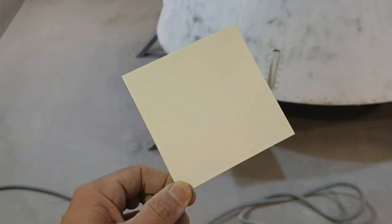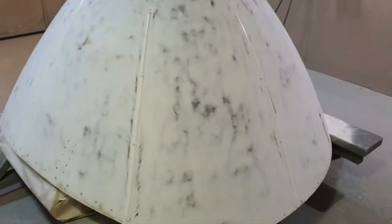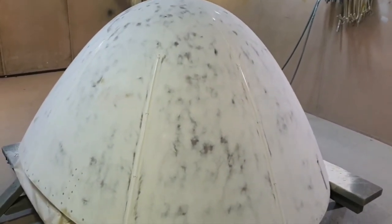Just while we're talking about the surfacer, we have to do samples and this is to measure thickness. Yeah, we've got to measure the thickness of all the major coats — obviously not the reactive primer because it's only thin anyway. But surfacer we've got to measure thickness of, and anti-static — we've also got to do a resistance test and continuity test. And then the anti-erosion that goes over the top of that has got to be measured for thickness, and then the base and the clear coat.